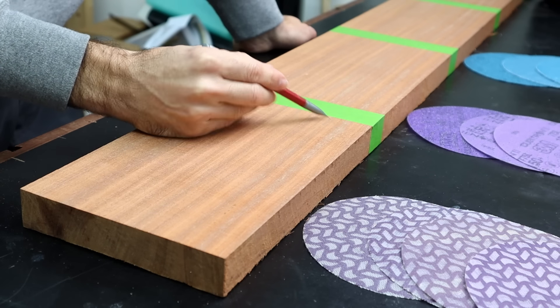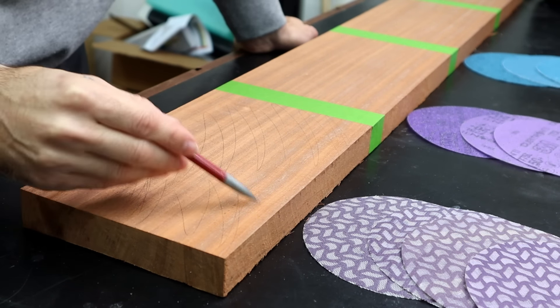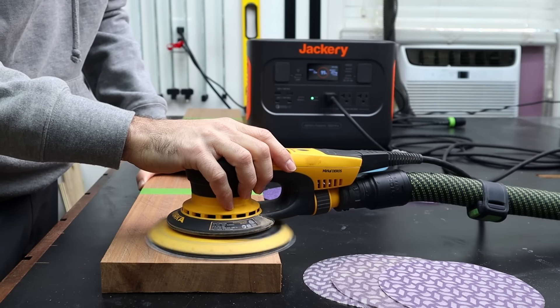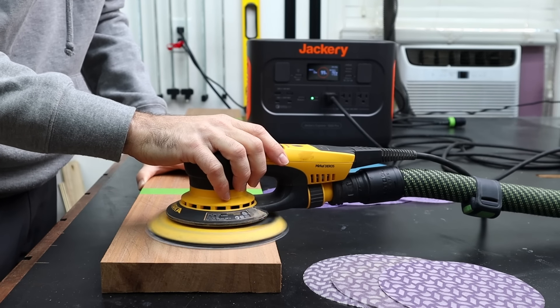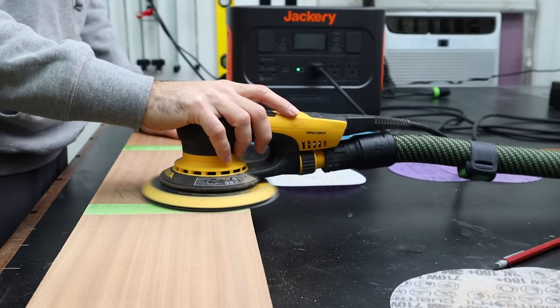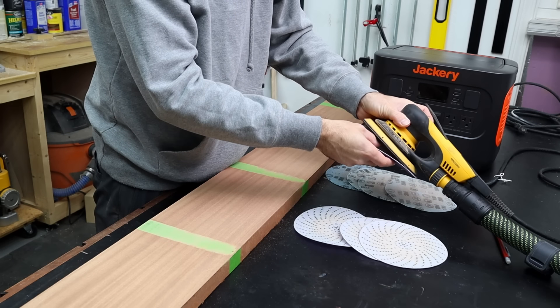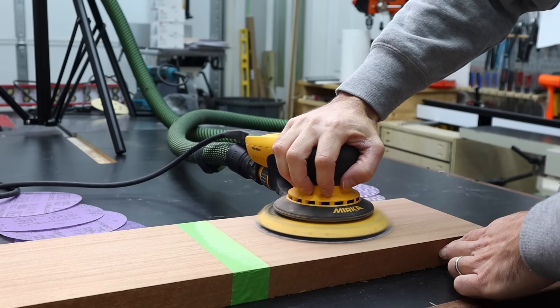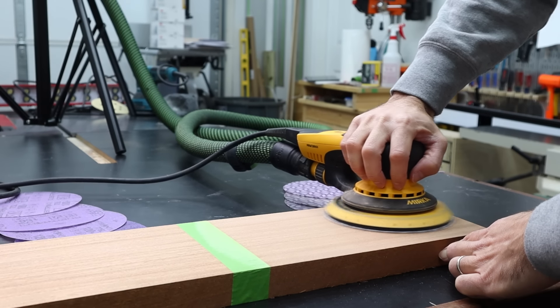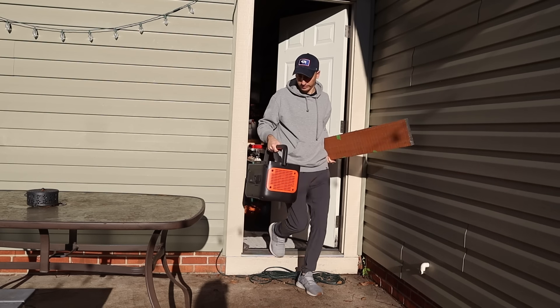To keep this fair, I'll be sanding the same board using my standard process. I start with scribbling lines all over the work surface. The idea is once the lines have disappeared, you've sanded that area enough and it's time to move on. I do this in between each grit — I started with 80, then 120, then 150, and finally 180. As far as technique is concerned, no reason to wiggle your sander around or push down. Let the weight of the sander do the work, moving about 1 inch per second. I also want to compare the results of a sander not hooked up to a dust collector, so I'm moving this operation outside and going through the same process.